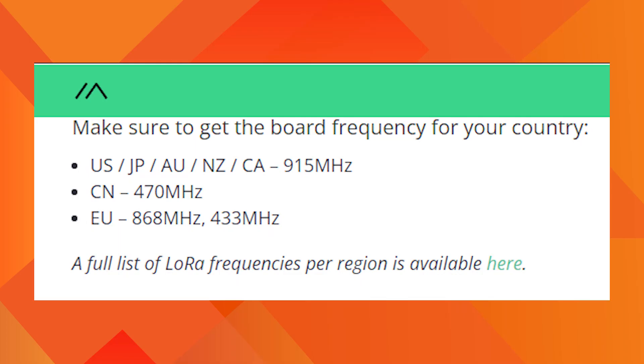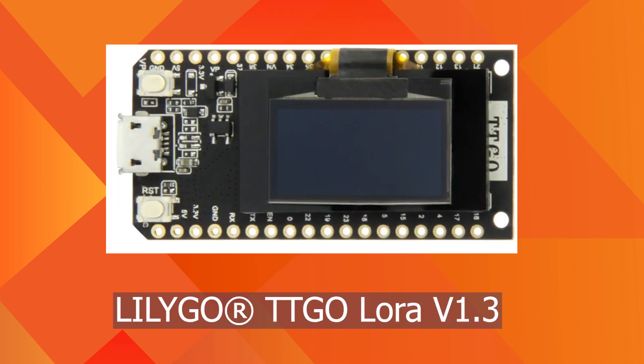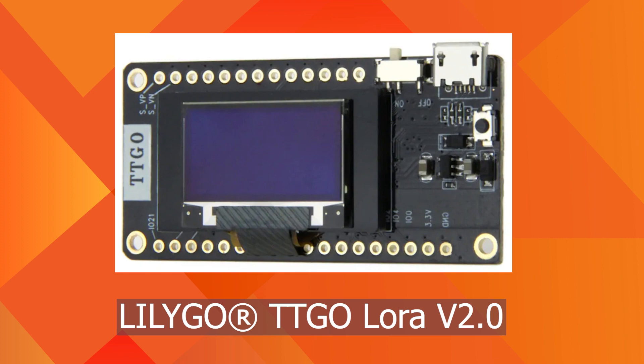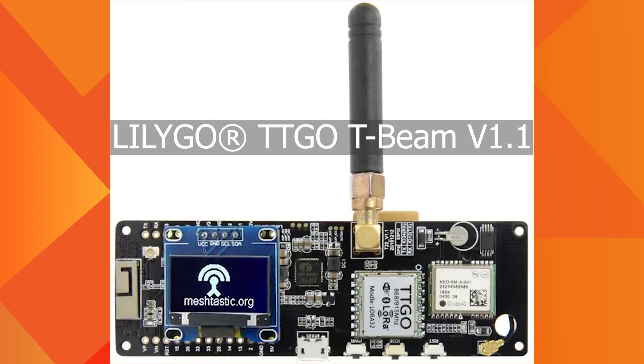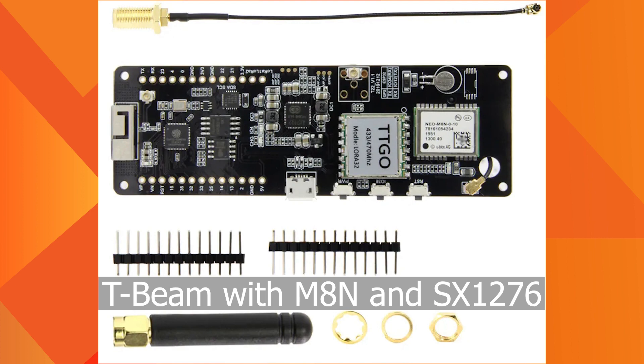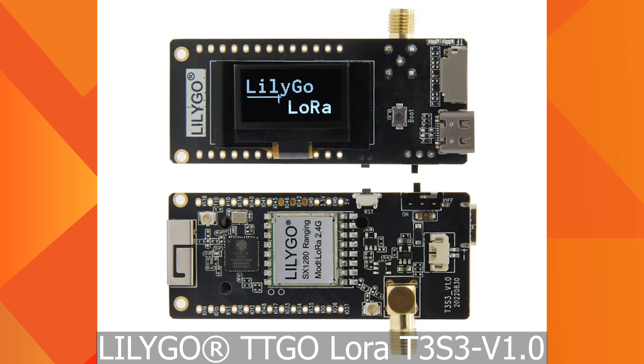You need to pick a device according to the allocated frequency in your region. Be very careful with the following devices, which use older Semtech SX127X transceivers and should be avoided: Heltec LoRa32 V2.1, Lilygo TTGO LoRa V1, LoRa V1.3, LoRa V2.0, LoRa 2.1-1.6, TTGO T-Beam version 0.7, T-Beam version 1.1, and T-Beam with M8N. Early versions of some of these boards also contained a wrong component in the LiPo battery charging circuit, allowing the battery to be overcharged. Additionally, the Lilygo TTGO LoRa T3S3 version 1.0 has a Semtech SX1276 transceiver option which should also be avoided.